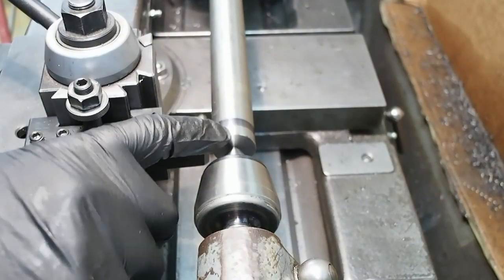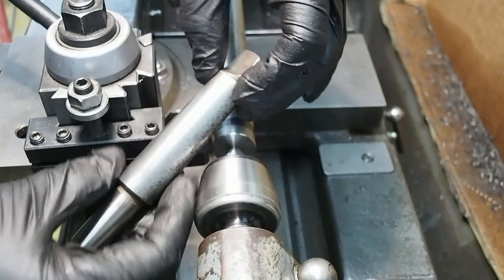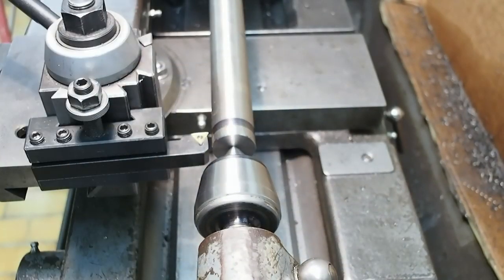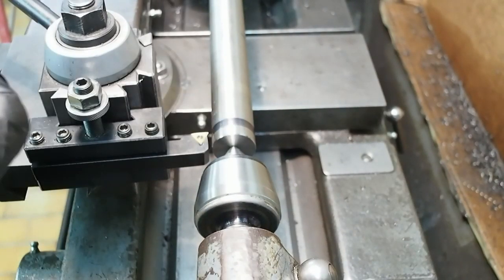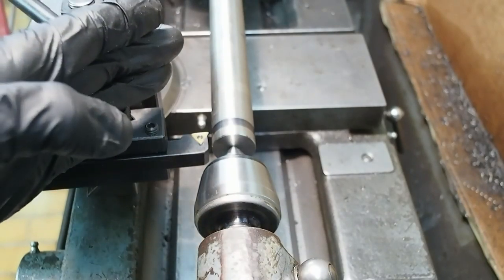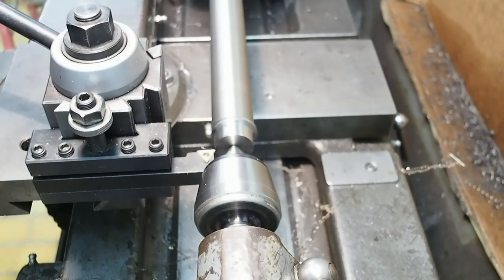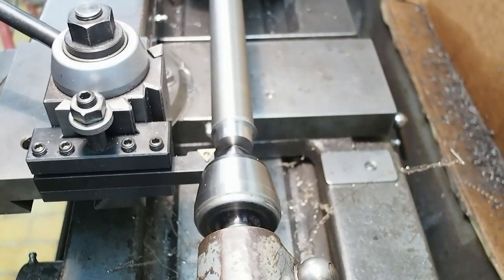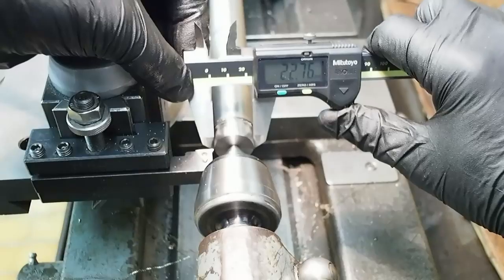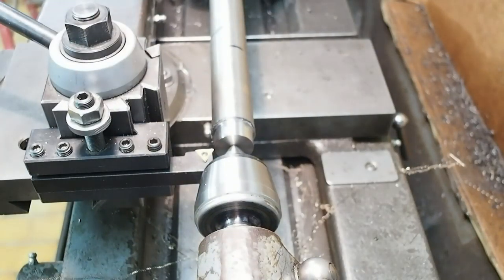This is plan B. I'll turn down this end just for 10mm to the minor diameter of the morse taper. I'll then have to print up another drive dog for the 20mm, flip it around and cut the taper — another 2.7mm to go.